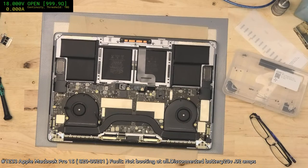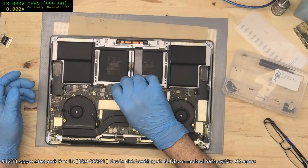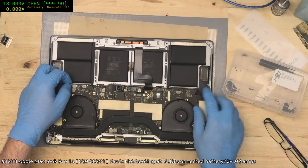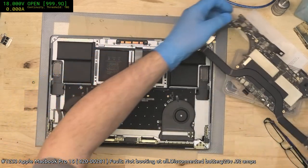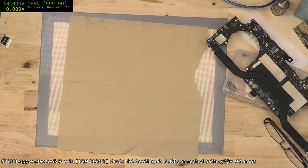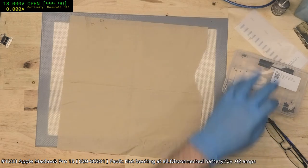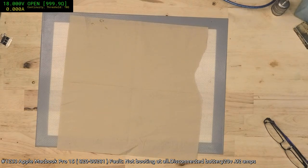So you got your 320 by 240 pure, no fusion, so 640 by 480 would be enough. I'd be more than happy with 320 or 640, to be honest, Creature. Because this one's a 160 by 120. Yeah, this is a 160 by 120, this one. So to get double the resolution, that would be pretty good, particularly if it maintains the same sensitivity on the sensor, because I do rely on the fact that I can pick up heat from down around about the 125 milliwatt region. So if I can keep that and get a higher resolution, that's a little more useful.